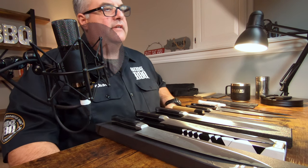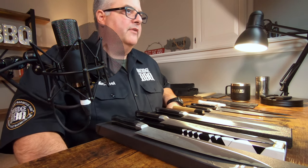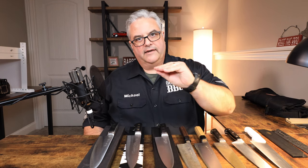Stamped steel is exactly what it sounds like. They're stamped from a die — literally like a press that presses the knife shape out of a sheet of steel. It might be cut with a water jet, lasers, or things like that. But basically those knives start from a flat sheet of steel where the knife shape is cut out, then it's hardened, ground, a handle's put on it, it's sharpened, maybe a little polishing, and then it's out for the consumer to buy.